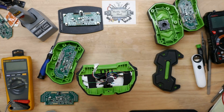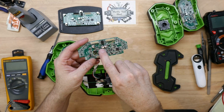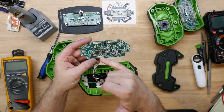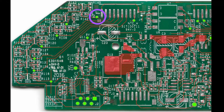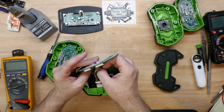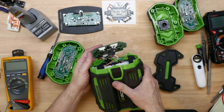One thing I want to show in this video is using one of the older gen 2 boards — this is one I removed the transformer from. This board has very good screen printing and test points to check individual cells. As shown in the board layout shared by David Keeler on my Facebook group called On The Bench, we have test point ground, then B1 through B7 on one side, and B8 through B14 on the other side, so all 14 cells can be monitored. The layout also shows where each test point goes to the connectors.